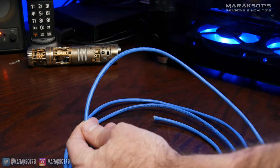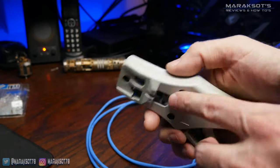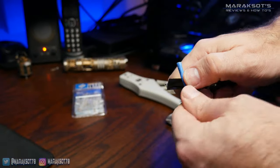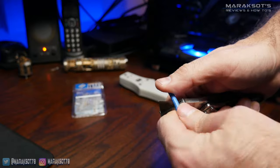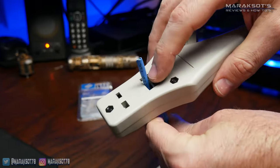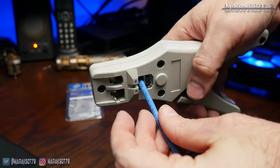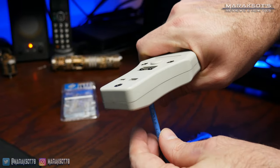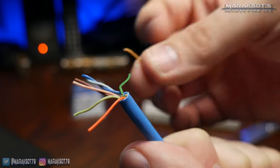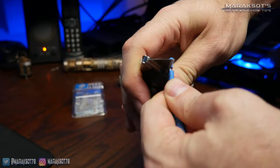You'll first want to cut your cable to the desired length. The crimp tool I have does have a cutter on it for this, but I prefer to just use my wire cutters. The next step is to trim off about a half to three quarters of an inch of the cable sleeving, and I prefer to use my utility knife for this. There is a cutter on the crimp tool which is supposed to cut the cable to length on one side and cut through the cable sleeving on the other in one simple step, but I've found more often than not it cuts through some of the wires too. So to save myself from having to hassle with it, I just use my utility knife.